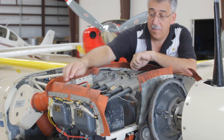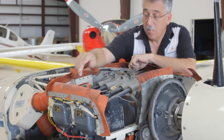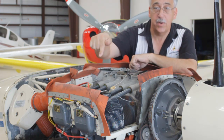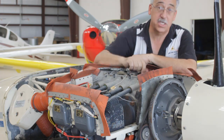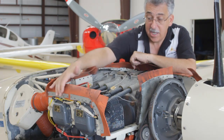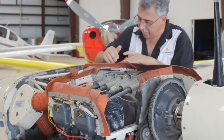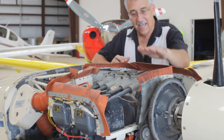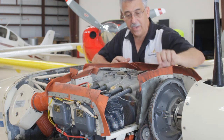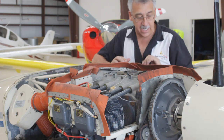Whoever did the baffling last time did pretty well by putting these plates on the outside, and that keeps the air from blowing in between. Most baffles I see out there that have been redone, they put the rubber on the outside of the baffle and pop-riveted in place, and the seal actually stretches out in flight between each one of those rivets causing a long series of leaks. So we usually put the rubber on the inside so when it blows out it touches that baffle — or you can do like this guy did and put plates on the outside that sandwiches it. This corner can use some TLC to fix up. This baffling shouldn't be here at all across the front; that's supposed to be the felt piece around there. We actually have a baffle that contacts that in our nose bowl, so we're going to have to do something a little creative to make sure that all seals up nice and tight.